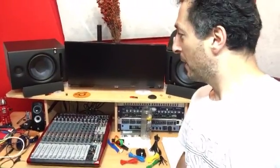So that's what's happening, and the reason is that I am setting up my new mixing desk. That's my Behringer UFX 1604 that I purchased a couple of weeks ago, and that has now replaced my main audio interface, which was the Mackie Onyx Blackbird, which was 8 in, 4 out, or 6 out, something like that. So now this is a 16 channel audio interface and a mixer at the same time. It's also Firewire or USB connection, giving me 16 multi-track straight into my DAW, and I think 4 tracks that come back from the DAW.